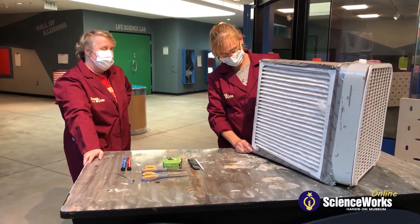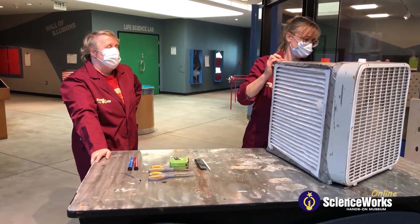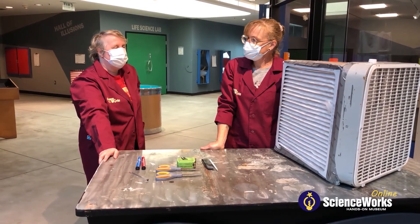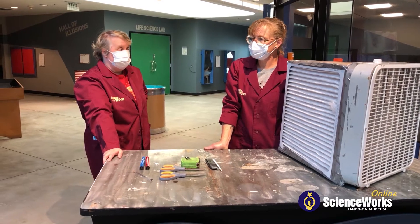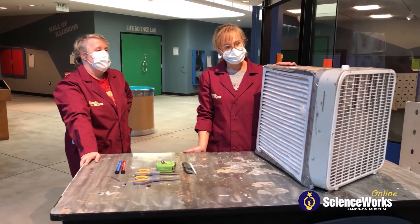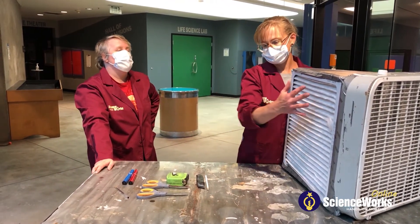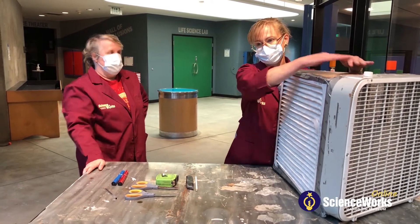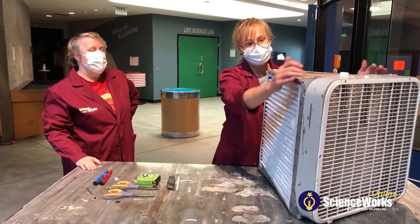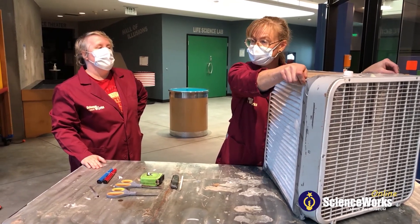So we just took duct tape and we make sure to cover all the little holes and gaps that we can find. If you don't have duct tape, is there another kind of tape that would work for this? Yeah, the packing tape can be good. You want anything that won't allow air through it. The reason why this is effective is because you are isolating the amount — any air that goes through the fan is going to go through the filter, because you're blocking any other place that the air can get in. So if you're using a paper tape like a masking tape, that might not work as well.